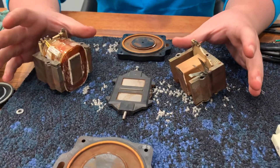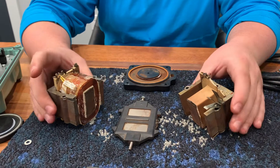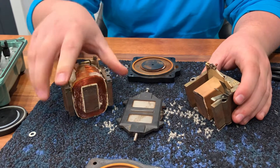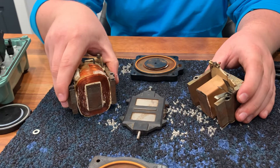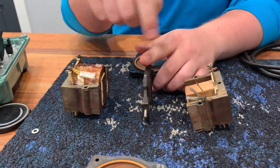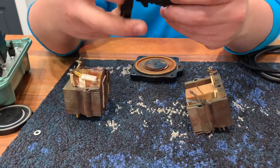A lot of aerobic septic systems will use a linear diaphragm air pump to aerate their systems. After you plug it into a power supply, you're going to have a current coming through this wire here. Current coming through this wire will cause this assembly here to become an electromagnet. You'll have two electromagnets in this machine, one on either side of a permanent magnet here.